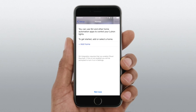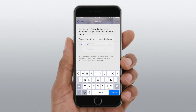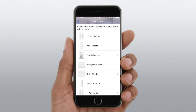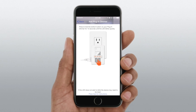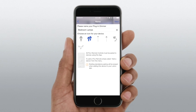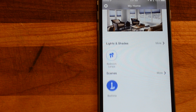We're then going to set up our home. Hit the add home button and give it a name — this is basically allowing the Siri and HomeKit integration to work. Next, add the setup code found on the bottom of the device or on the included piece of paper, which ties your bridge to HomeKit. Then add your devices: choose the dimmer outlet switch and do the same pairing process — hold down that bottom button for about six seconds, choose an icon, give it a name, and hit save in the top right corner. You can also add the other switch and the two remotes.